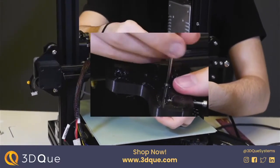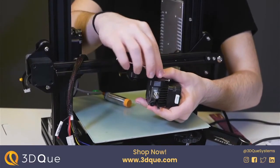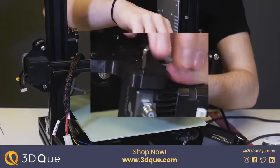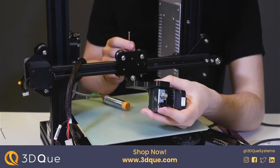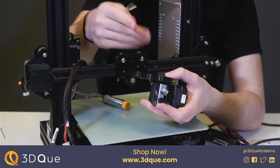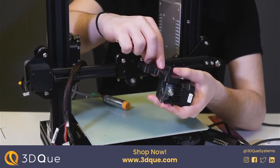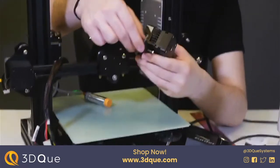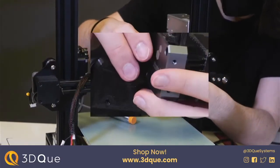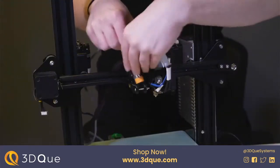This part was printed at 1mm extrusion width and took just over an hour, which is not that bad. One thing people overlook with 3D printing is that if a surface isn't visible, you can go really thick and not worry about it. There's a really handy feature in Cura where you can skip every second or third layer for infill since no one's going to see inside the part. You can also use bigger layer heights on the inside than on the outside, and in Cura your inner perimeters can have higher layer widths than your outer ones.